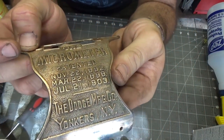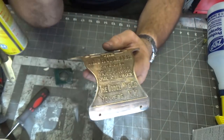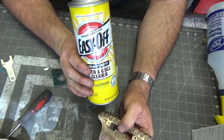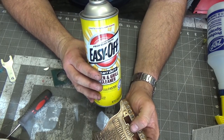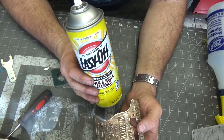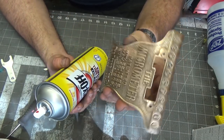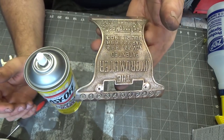Before I start mixing up batches of weird concoctions, I'm going to try what's been a relatively useful staple. Many moons ago I used to work at a machine shop, and when we had something metal that was very dirty, oven cleaner was the go-to. We had hot tanks and engine block cleaners, but every once in a while we'd have something so bad that carburetor cleaner and brake cleaner just wouldn't touch it — so we'd use oven cleaner. For about $5.50, I think that might get in there and get some of this schmoo out. If not, we'll go with the other recommendations.